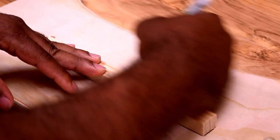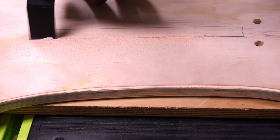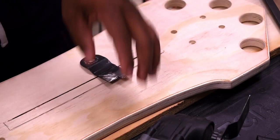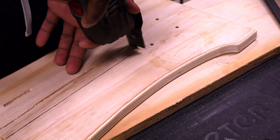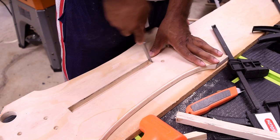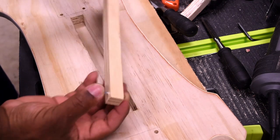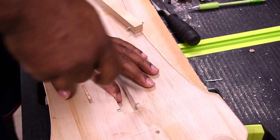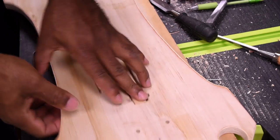Refer to the template and trace out a piece of wood that will sit into this opening. Cutting out this hole can be tricky depending on the tool you're using — because I didn't want to go outside the line I'm using my multi-tool. For this pivot point, I drilled an eighth inch hole half an inch from the edge. The best thing I could come up with was a nail cut in half to give me this pivoting point, then notch out this section deep enough so that the wood sits flush on the top side of the skateboard.